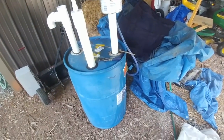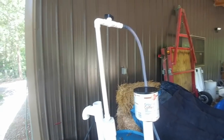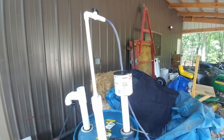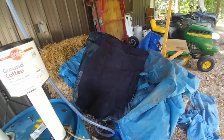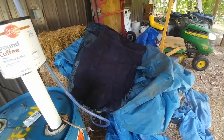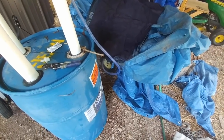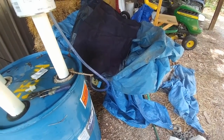In this last clip on the biogas digester, I'm not sure why the directions told me to make the half-inch pipe as long as it is — I may end up cutting it down. I got a tube connected to the plumbing going into a twin air mattress. I was going to buy a Puxin brand bladder specifically designed for this, but after talking to my buddy in Hawaii, he said just use a regular air mattress — so that's what I did. I set the valve to deflate so it was open.